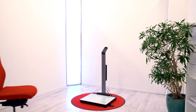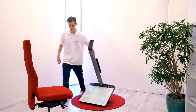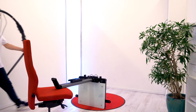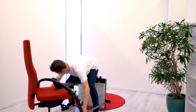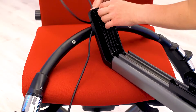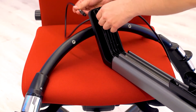Place a cardboard box or a chair in front of the device and tilt the unit forward until the column rests on the raised surface. Now, lift the BIA standing aid over the column and align the two poles with the holes in the cross beam. Guide the two BIA hand electrode cables from the center of the standing aid through the opening at the top of the handrail connector.